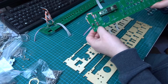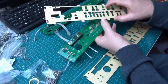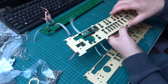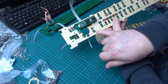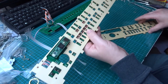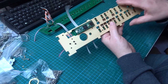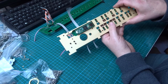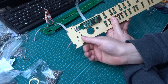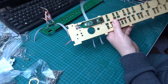The switches clip into place and then you just solder them on the back. There's this panel which has the rather odd-shaped cutout — it goes there. These cutouts allow for the protruding solder points, and then this one, which I varnished earlier with some spray polyurethane varnish, goes on there. You can see that the switches now protrude so they work. You've got room here for the cable to come through and plug in.